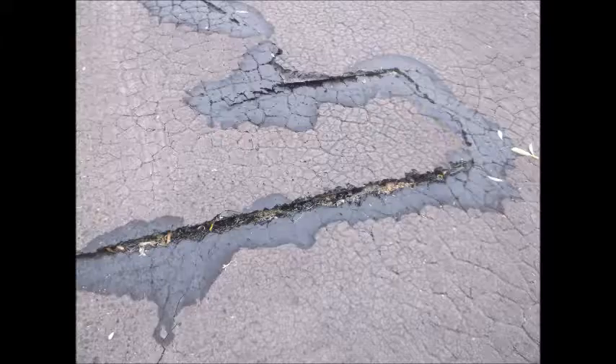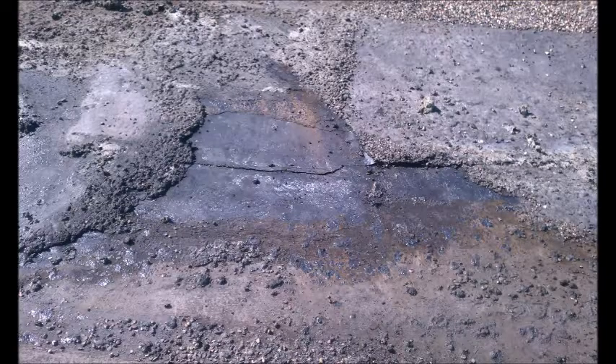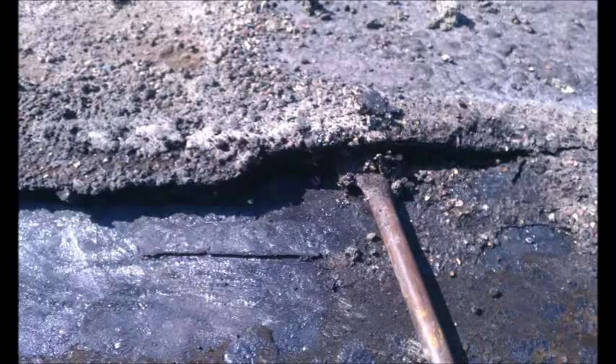In the middle of the roof we look for cracks in asphalt roofs and seams that are opening up in single-ply roofs. We take a small probing tool and gently see if we can work our way into the opening. If you can get your tool inside, the water will be in there also. If you see something loose, give it a tug.